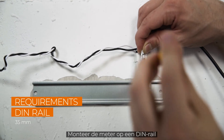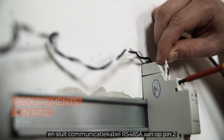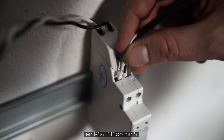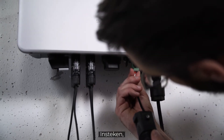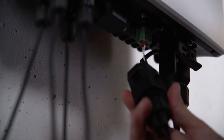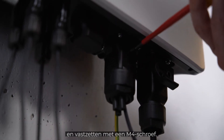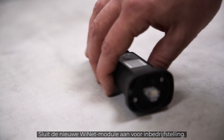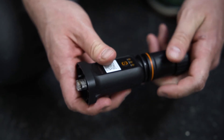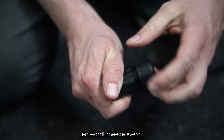Mount the meter to a DIN rail and connect the communication cable RS485A to pin 2 and RS485B to pin 5. Plug it in, screw it, and fix it with an M4 screw. For commissioning, you have to connect the new Ynet module, which combines Ethernet and Wi-Fi in one port and is part of the delivery scope.